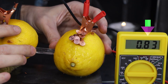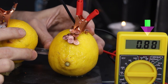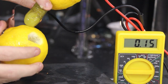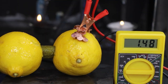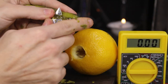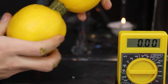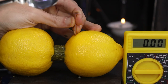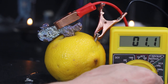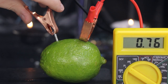If you want to do the salt bridge connectivity experiment yourself between two separate lemons, you won't need a glass tube — all you'll need is a pickle. The pickle works well for its high salt and moisture content. You can peel back a bit of the outer layer to expose more of the softer underside, which should help the connectivity. You can change the size of the pickle to see how that affects the bridge, as well as try different metals and fruits to compare the different voltage and amperage readings you get.